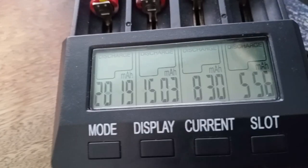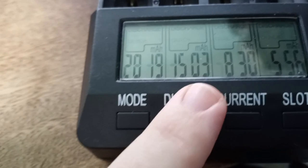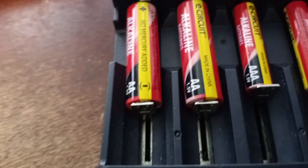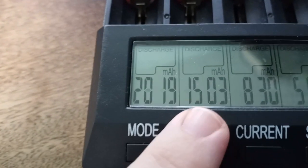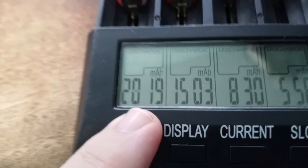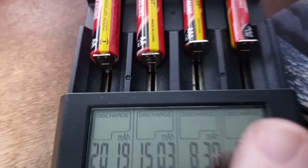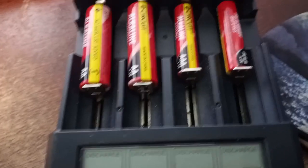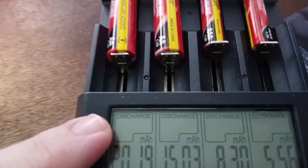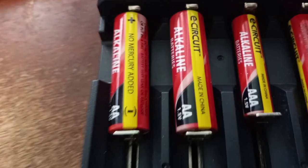So these definitely have less capacity than the Harbor Freight batteries. This one is about the same, but I got more off of a 500 mA discharge than I did with this one. Even though they're for high drain devices, that definitely hurts the total overall capacity — you can get 2000 mAh, or 2 amp hours. If you buy 4 packs of these, it's about the same price as 1 pack of the Harbor Freight ones with the 18 count. You'll get 16 batteries with this, you'll get 18 with the Harbor Freight ones. Of course, this is from the Dollar Tree — the E circuit.